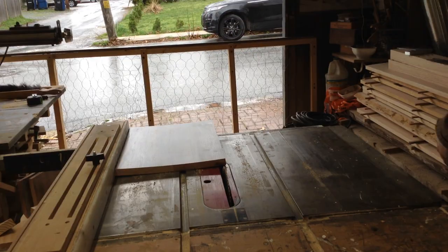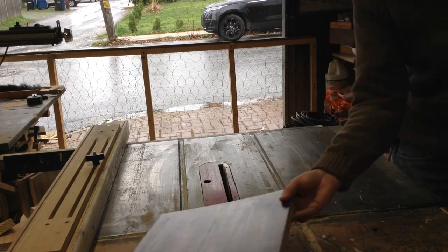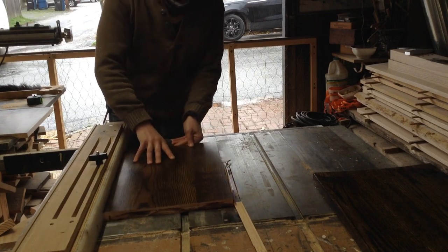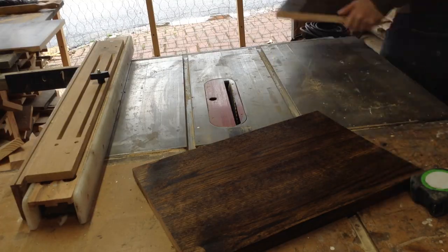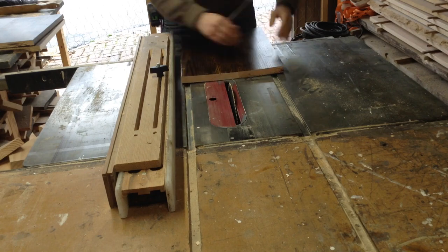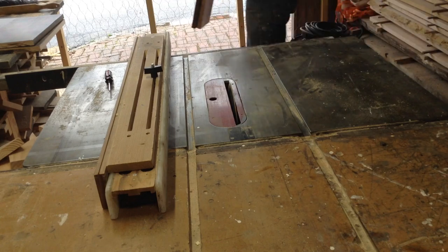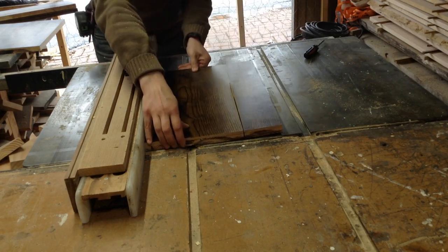That would have helped with part of my cupping issue — I don't think it was the main issue but it definitely did not help. For this little tabletop, since the pieces are much smaller, I can flip them because I don't have that center piece where I cut out all of that material. I'm cutting these down into smaller pieces, and there's still quite a severe amount of cupping, so I decided to cut these down at the joints, then flip every other piece and re-glue them. This was also another time I was pretty impressed with the Waterlox finish — I'm cutting this up on multiple machines dragging it around my shop and there were very few to no scratches in the finish.